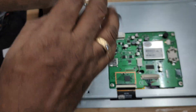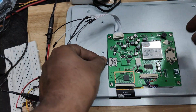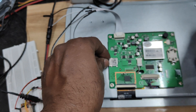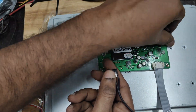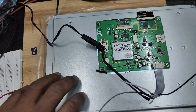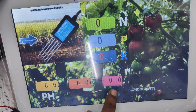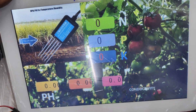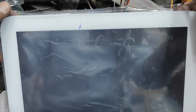Click on save and then generate. Now we have to upload the DWIN_SET folder using the SD card method. Copy the DWIN_SET folder to the SD card, plug the SD card into the DWIN display, and then power up. You will see a blue screen showing that the files are being downloaded. After completion, remove the power, remove the SD card, and power it back on. You can now see the project on screen—the first image appears and after a delay the second image is displayed.